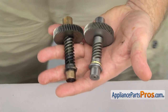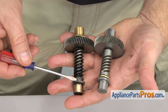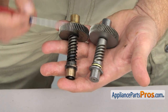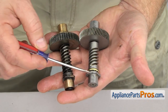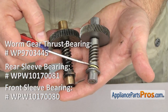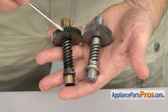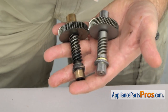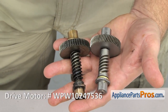If you're in here changing out the worm gear, they did discontinue the original one. So if you have an older one like we did that has the front and rear sleeve bearings that are the same, and it has a one-piece thrust washer, this is no longer available. So you're going to have to upgrade it to the new one. At the same time, you're going to have to put in the new sleeve bearings. The front is different than the rear, and the thrust bearing is a three-piece bearing. Also, the old worm gear had a 53-tooth gear on it and the new one is a 60-tooth gear. So when you're upgrading to the new worm gear, you're going to have to also change out the motor from the old 8-tooth to the 10-tooth one.